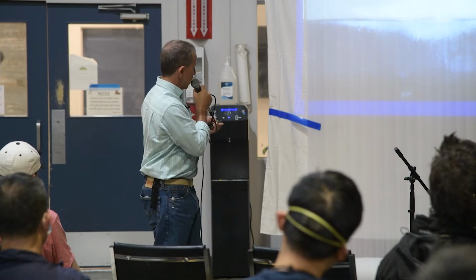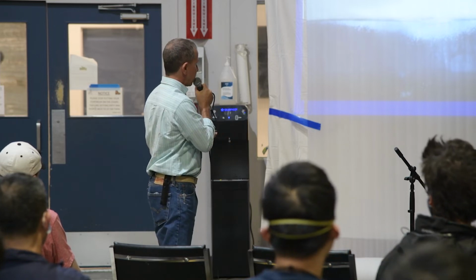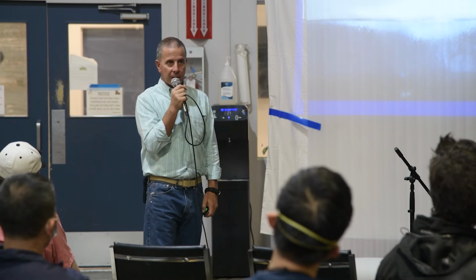Areas where you've got water running on a regular basis, like a limber hole or a drain, running out over a painted surface that then interfaces with something else and water can get trapped. Once again, this is a rub rail on that boat, and it is a black rubber that has carbon in it. Water is running out over that and getting trapped in that gap right there, and you can see the paint is beginning to fail on that aluminum structure.